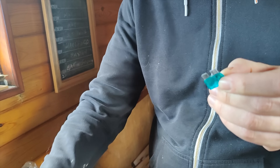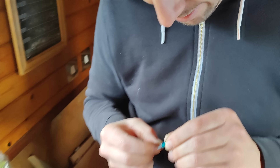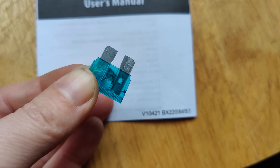The plastic's actually exploded — there should be a wire that goes between that and that and you can see it's all frazzled. I've been testing all the fuses in this little cupboard and I come along to the one which I believe is for the pump switch on the wall. Look at that — frazzled! So I think with any luck we can change this fuse and then we'll have water.